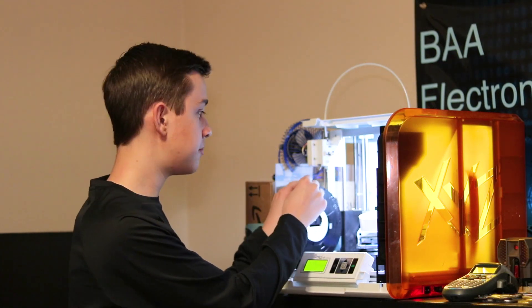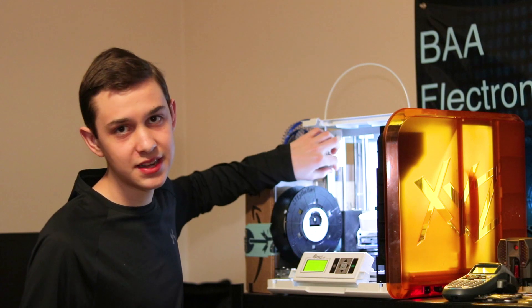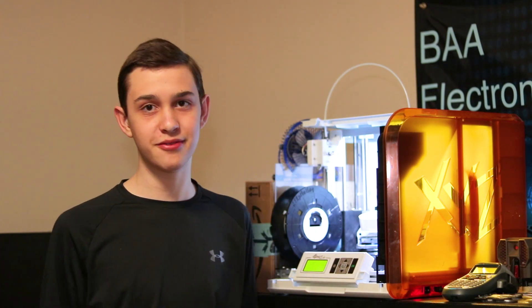If you are using old filament and it breaks off, remember to load the filament every time you create a new print. As you can see, it's kind of broken off from the feeder, so it's not going to work for more than a few seconds at a time. I definitely recommend going through the menu and manually loading the filament through to get a little bit flowing through the extruder before you print.